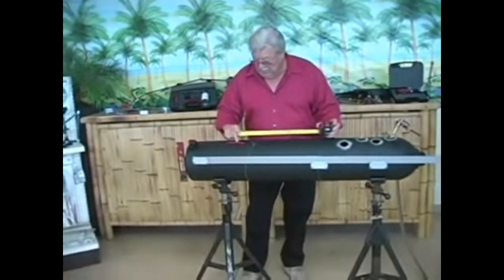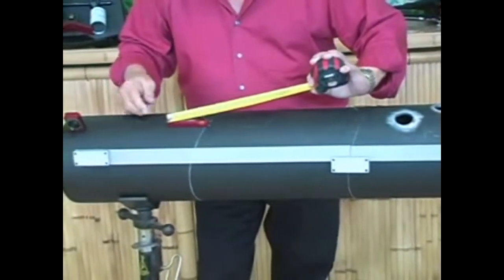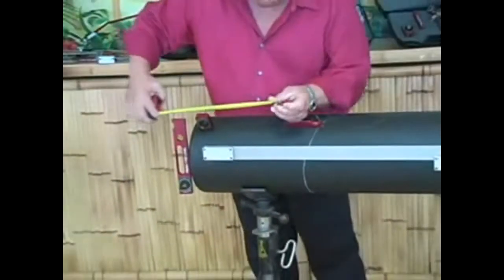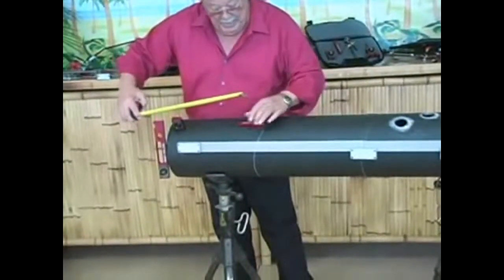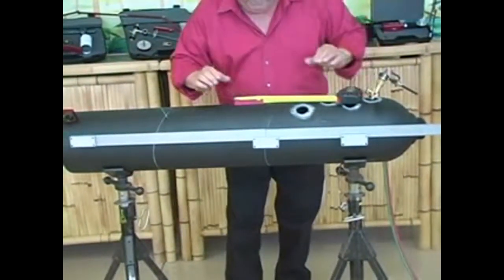A line is never complete without having levels of all different sizes. This first little level, which is very small, has a 25-pound pull magnet on the very bottom. Plus it has a magnet on the end, which is a rare earth magnet, which is very strong. What I did this for was, not only do you have a little shirt pocket level, but you have something to hold your tape. This tape, you can go as far as you want one way, but you actually can turn and go the other way. It holds it. Some of these new tapes that you buy now have magnets in the end of them, but you can't use them when you're in the middle of your work. There's nowhere to hook them. So this here, you can line up with your line, it'll grab your tape, but you can also turn and go the other way with it. This has proved to be a very versatile little tool, and the pipe fitters really like it.